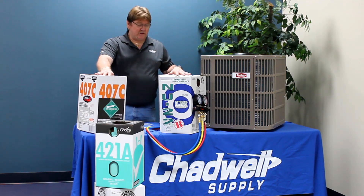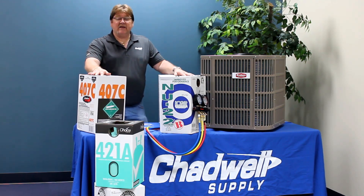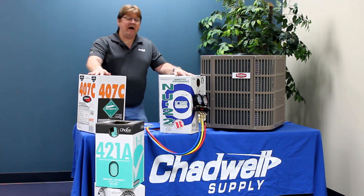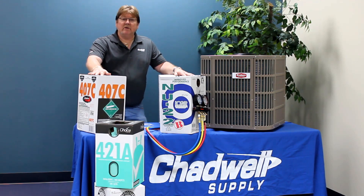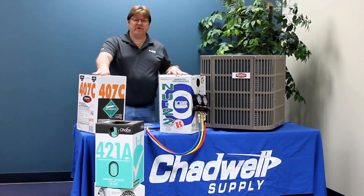We use the term loosely saying 'I need a drop-in refrigerant,' and I think it needs some clarification. Because some people have a tendency to mean, can I drop that in on top of my existing charge of R22? And the answer is no. The refrigerant that's in the system must be removed, then the new replacement refrigerant added.